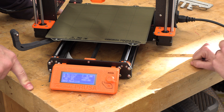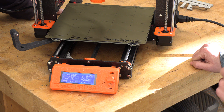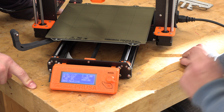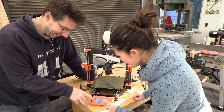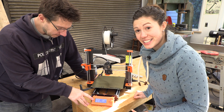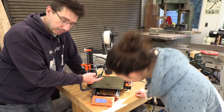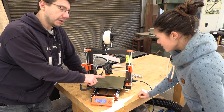If you're using weed whacker filament, weed whackers typically use nylon, which melts between 250 and 270°C. It is possible to use weed whacker filament because you just need filament that's the same diameter. Our next project will be incorporating weed whacker! We're finding out my shop is very poorly heated - I didn't get in early enough to start the fire. The bed's going to get to 60°C and the nozzle that melts the plastic is going to get to 215°C. Don't touch it when it's that hot - you will burn yourself.